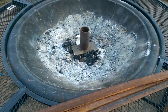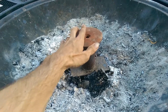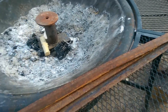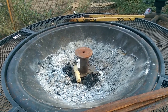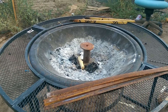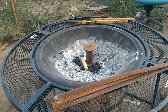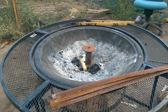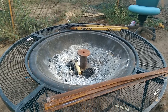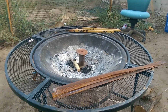Here's how I do it. I stick it in the middle of my fire pit, put the cap on, and then I build wood up around the base of it. Fire it up. It takes about a good hour, maybe a little bit longer, to get a hot enough bed of coals to really heat that steel up to a nice cherry red, which is more than enough to melt the aluminum inside.